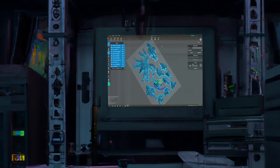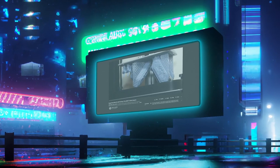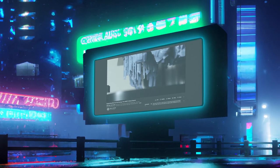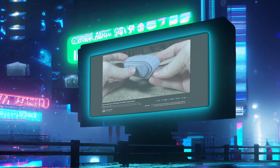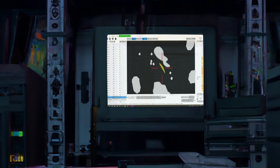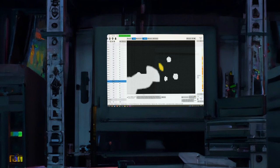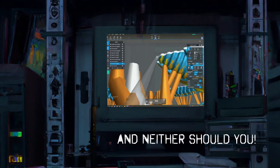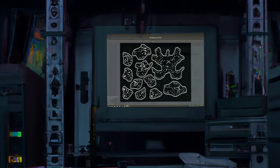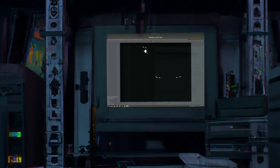I prepared a plate of the Cyberpunk and Giga-esque minis for printing, and imported the sliced file into UV tools to check the unsupported islands. If you don't know what I'm talking about, I have a video all about the most critical aspects for supporting miniatures for 3D printing — but long story short, unsupported islands are not ideal and often bad. Regrettably I did find unsupported islands here, which just sucks. People have asked me why I don't just use UV tools to try and repair what issues it can, but the point is I shouldn't have to. There should just be supports where they need to be, and by printing the files as provided, I can get the most accurate picture of how good or bad a miniature subscription is.